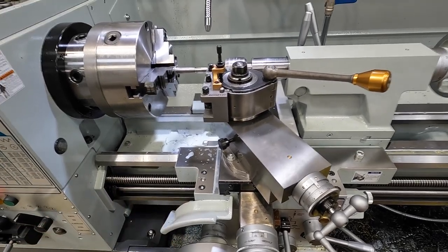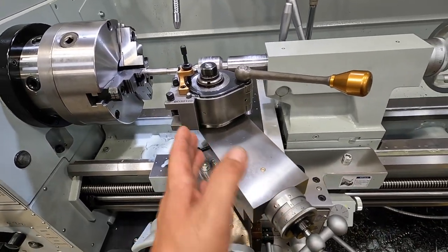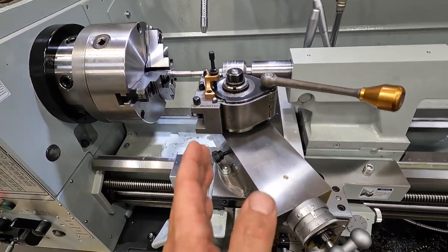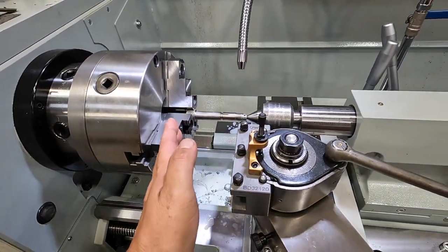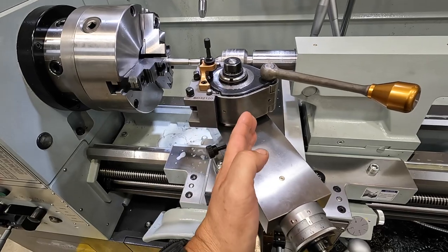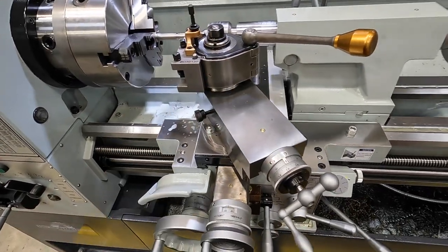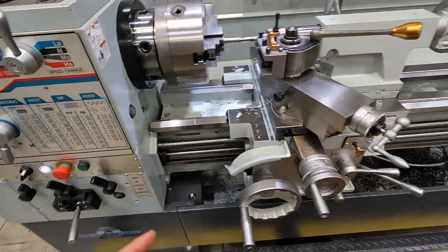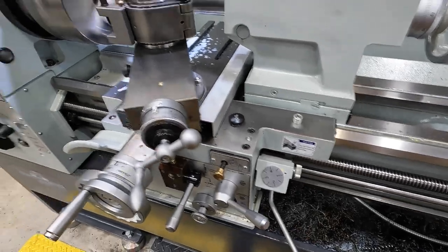But you've got to be able to line up your tool with a thread. So if you have your compound set at any angle you want, that's okay, because you just need to be able to move your tool so that you can line up with the thread right there. If you don't want to use this for end feed, you don't have to. I use this for end feed. All right, so we're going to set up for an 11 pitch thread. And let me see, let's go ahead and...